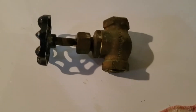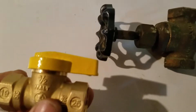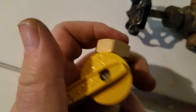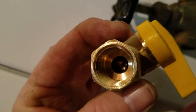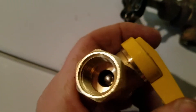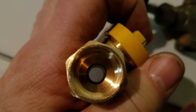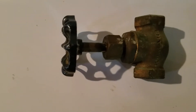This is what we had before — this is primarily for water. You can tell because that's a blue handle. This is what we're going to — this is a ball valve, and with the yellow, that signifies it's for gas. When you turn it halfway across, 90 degrees, that shuts off all the flow. And as you open it up, whatever you're hooked up to lets it flow through. So that's going to be replacing this one.